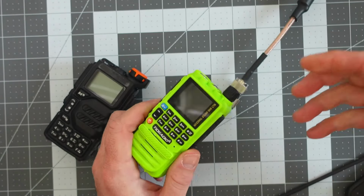And hey, by the way, this radio does airband mode. The cool thing about the airband mode is there's a little bit fuller of a sound on this radio than there is on something like, say, the UVK5. But there were some problems here. You can program with CHIRP, and you can program manually on the front panel display or through the software. On 1.25 meters, if you do choose to unlock it and use it, you cannot program any offsets or repeater frequencies. It's kind of like a simplex only mode, which is pretty interesting.